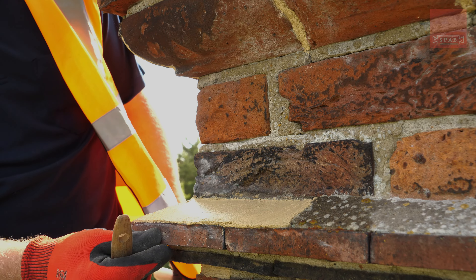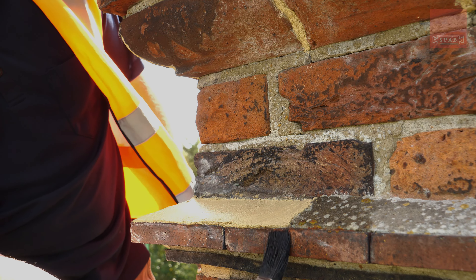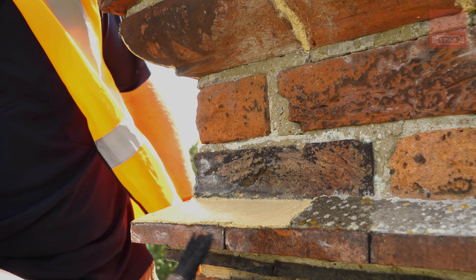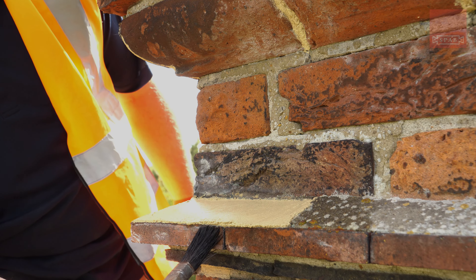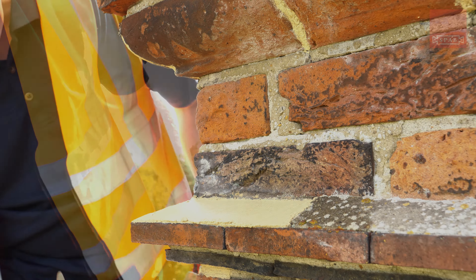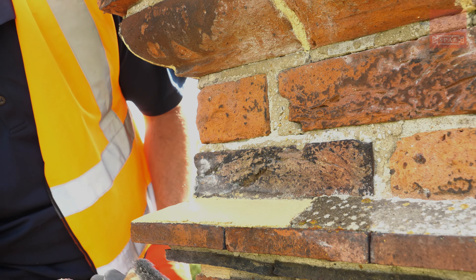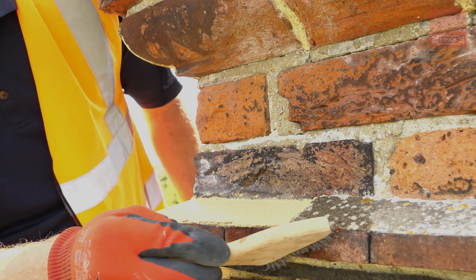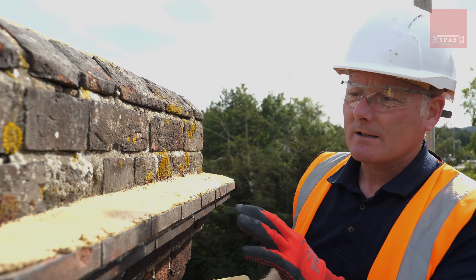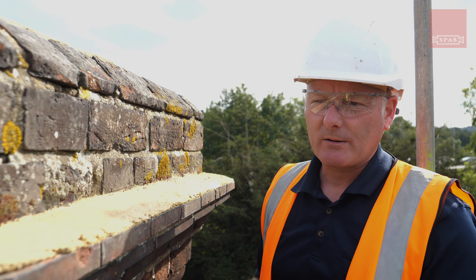You have to be very careful about staining. Where you've got some brick or tile which is not very absorbent, you can dip a brush in water and take it along the edge — that will take any staining off. If it's on brickwork you can always use a very gentle wire brush and take any staining off that way.